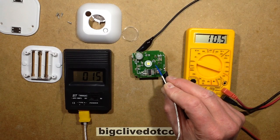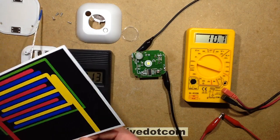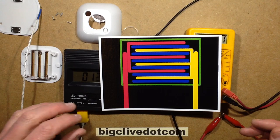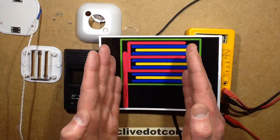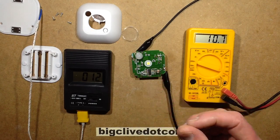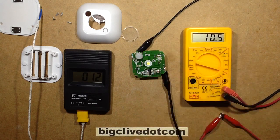It's marked 105, so that suggests it's a 1µF ceramic multilayer capacitor. The way ceramic multilayer capacitors are made, this is possibly down to them trying to make it too small for that capacitance value. The structure has layers of ceramic with conductive layers, alternate layers bridged to either side, and metallisation ends. To get a value of 1µF it's been done very finely, and somehow a contaminant has got in and created some sort of resistive effect on that ultra wafer-thin ceramic layer — as a result it's passing quite a surprising amount of current.